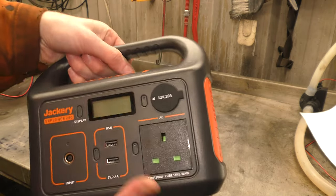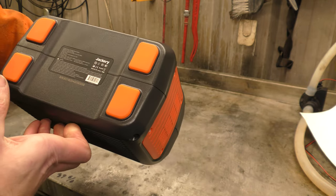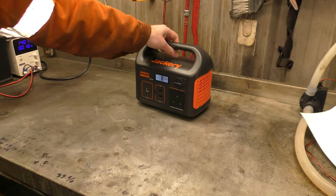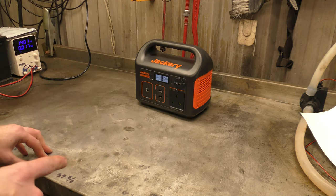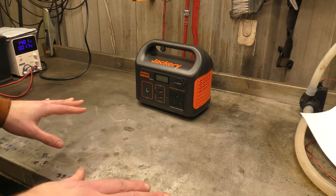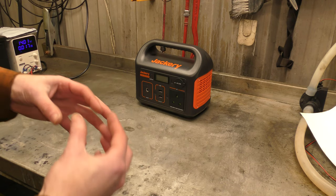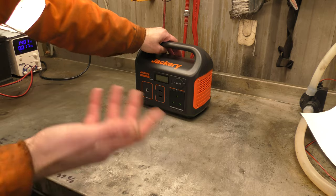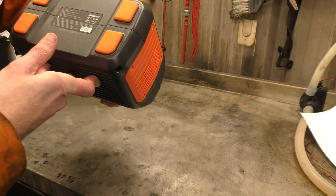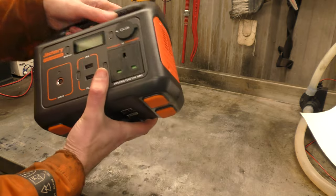At the moment it's fully charged. It has a claimed rating of 241.9 watt hours. So I used my little USB tester. I'll put a clip of it on the screen of me testing it. I ran it all the way down until it cuts out — which is its flat point — and then you plug the tester back in on something that's got voltage and it saves where it cut out. And I got 244 watt hours, so it actually delivers the claimed capacity.